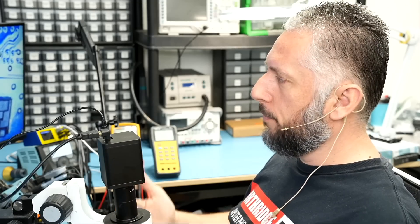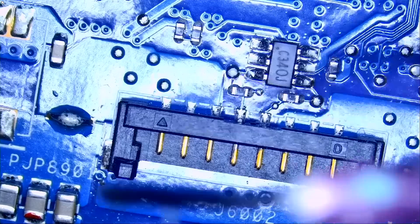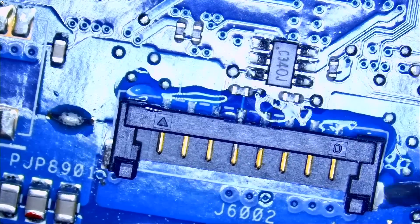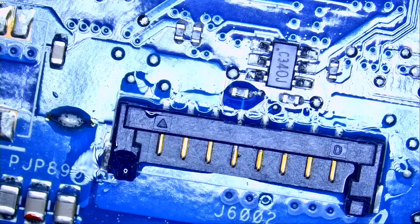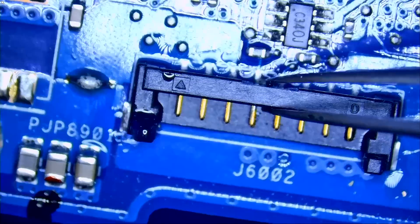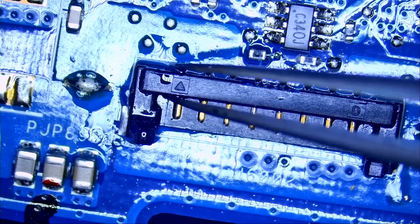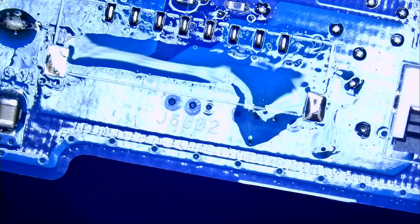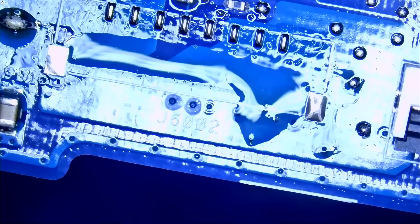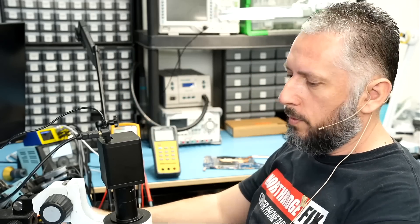The board is going to extend beyond my bench so I can point my hot air nozzle from under the board. We apply flux to help with the flow of solder. Beautiful — we did not damage the connector and we pulled it out as a whole. Let's go back to the customer's board.